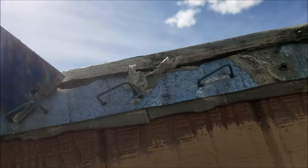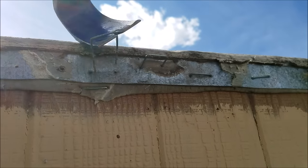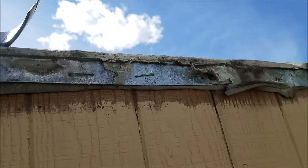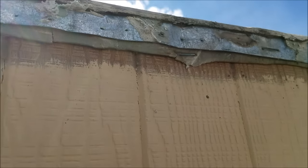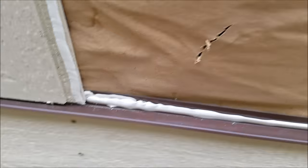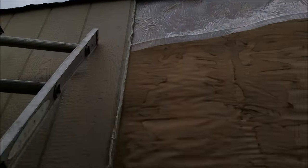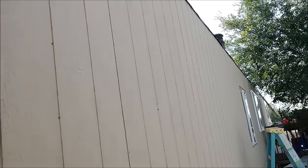We're going to get a magnet and pick all these up off the bottom — one of those roller ones you use to pick up nails and screws. It's a tedious process but rewarding in the long run. Now we're caulking this edge down here on the drip edge — we ripped down a piece and we're caulking this edge before we slap the other edge up in there, tucking it underneath that cap up there, making sure it's all sealed up.